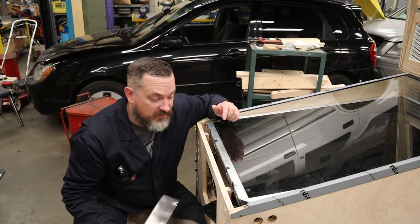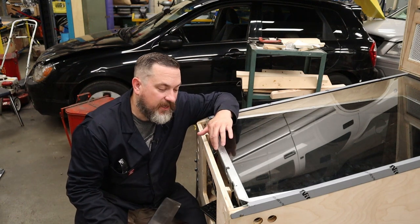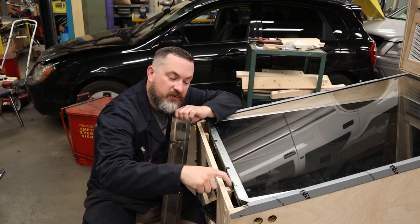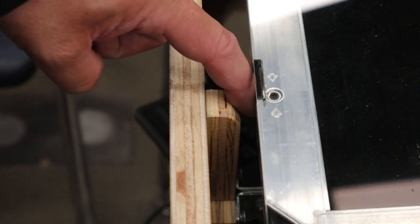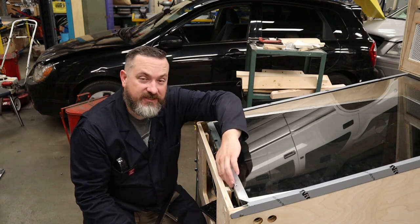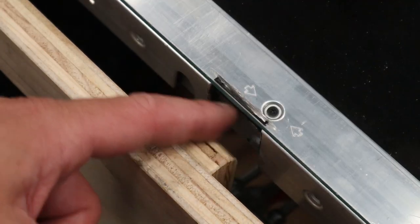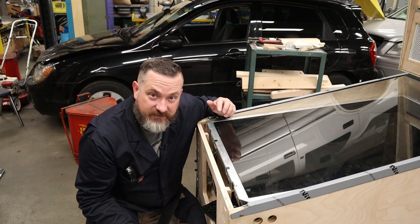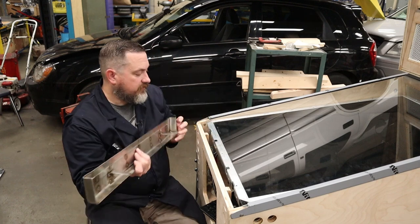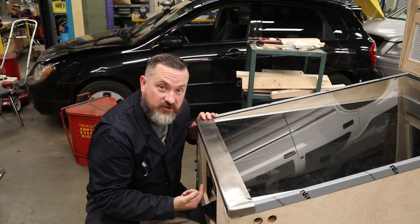However, it soon became apparent that I'm not going to be able to lift the monitor up because it's almost touching the glass right here, so that isn't going to work. So what I ended up doing is I squished the shape of the J-hook a little bit because it was a bit excessive, and then I had to put a little chamfer on the little wooden block so that I could come in at an angle with the J-hook to clear a little bit more. And then I still had it just barely touching the edge of the monitor and not wanting to go in. So I just took a little bit of the aluminum and plastic off of the frame, or the bezel, and it does not take any of the strength out of it. There's actually quite a big bezel on this monitor. So I had to do that to get this to work, but now that goes in at a slight angle and then J-hooks from underneath.